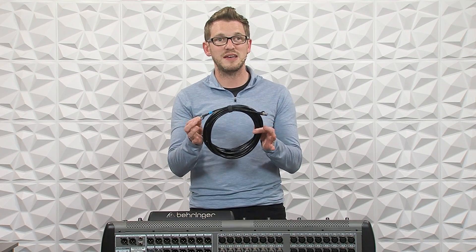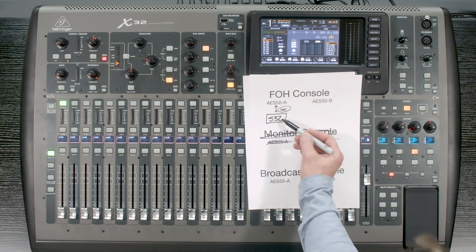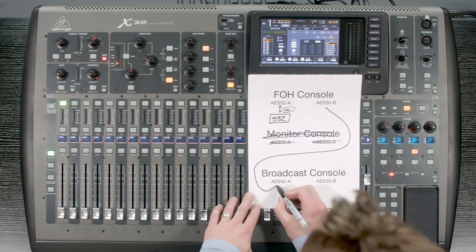When setting this up, make sure you purchase a shielded cable — it can be STP or UTP/S. There are a lot of different shielded cables available, so talk to your integrator to get the right cable. Now, we have our 100-foot shielded cable connecting our AES50A port to our S32. We have the B port remaining, and we need to connect this into our broadcast console using a shielded cable going to the AES50A port of our broadcast console. For Chuck, he's going to use about 5 to 10 feet since it will be sitting right next to it. If you have the ability to put your broadcast console in a different room separated from the main auditorium, that's great because you can get a better listening experience for the person mixing that broadcast mix.